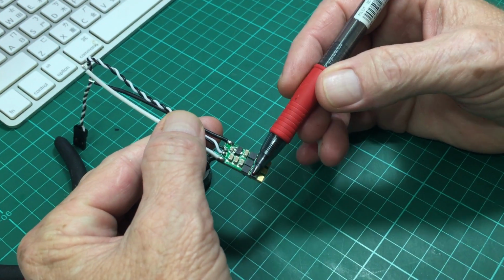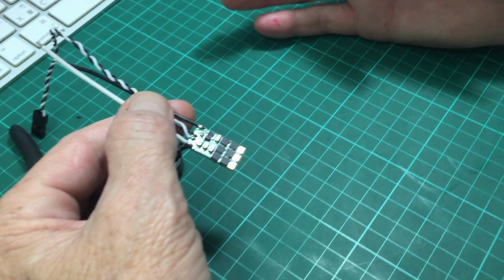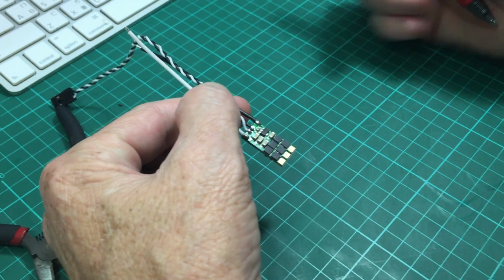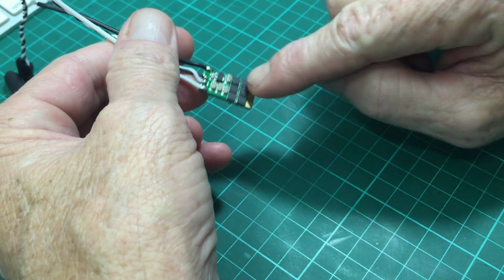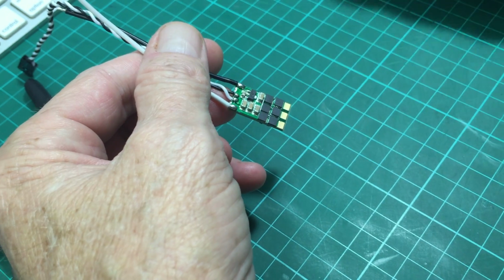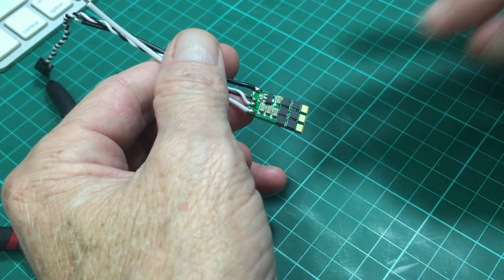These little guys here, while soldering their motor to this. And I get customers, not that many, but a few, who email me explaining that they may have a problem with one ESC, and what I usually do is ask the customer to send me a picture of the solder joints on the ESC, because a picture can give me a very good idea of whether the person who soldered the ESC has proper equipment and proper solder to achieve this, or if the person is likely overheating these.